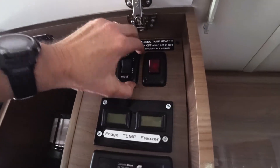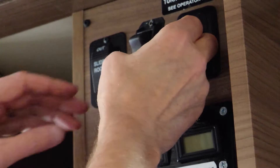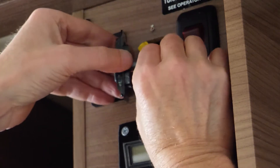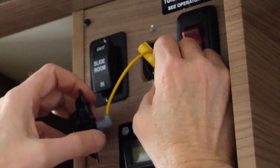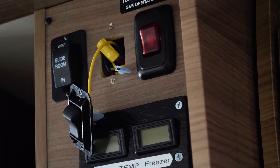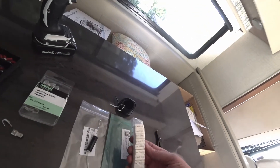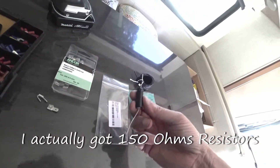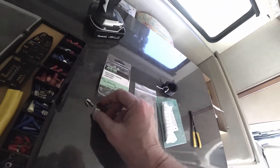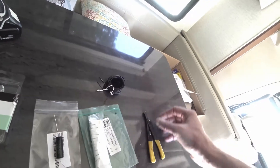The first thing you can do is pry off the cover on this, over the switch. Take the bottom part off. This is what we're going to add between the bottom and the switch. Here's what you'll need to make the modification: 130 ohm resistors, a 500 microfarad capacitor, some adapters for your switch, appropriate crimping tools, a little extra wire, cutters, and of course a drill.